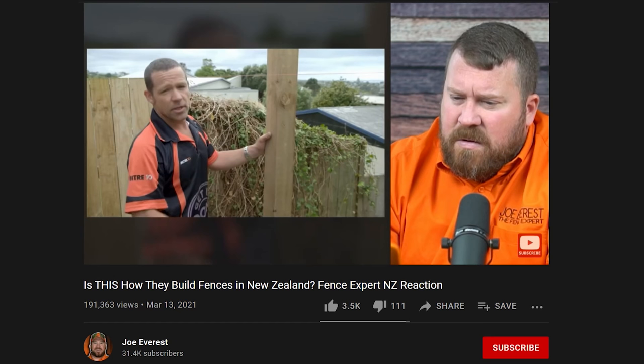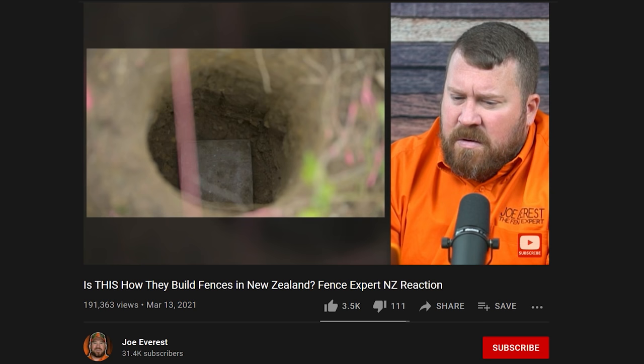He's putting stones at the bottom of the hole. We've seen this in previous review videos — in the New Zealand review video they put a solid chunk of stone or a paver at the bottom of the hole. The idea is to keep the post up off the ground when it's being set. In the comments for those videos you really see it go either way — some folks prefer to have the post stand up off the ground, others say it's unnecessary. My opinion is it's probably a good idea. I don't think it could hurt to have the post stood up off the ground to avoid ground contact at the bottom. Does it help? I think the jury's out, but does it hurt? Probably not.